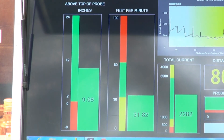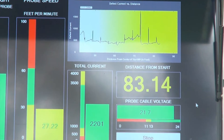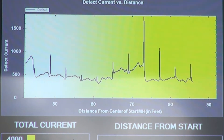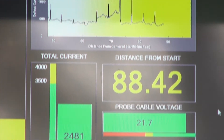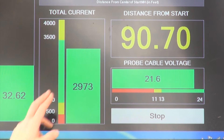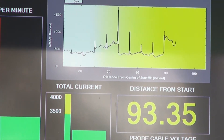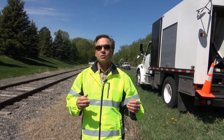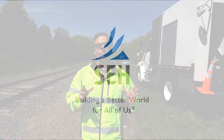There's a video screen and you're able to see the raw data and see at how many feet there was a defect. The other thing I really like about this technology is that if you have put structural liners inside the pipe or a slip line of some sort, it tests the quality of that installation. So before we do our pavement management project, we'll televise, electro scan, do our repairs, come back through an electro scan and make sure that the liner we had installed is actually doing the job we want it to do. It gives us a really good handle on the quality of the job that we paid for.